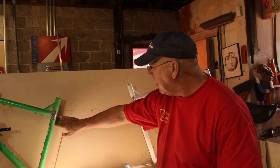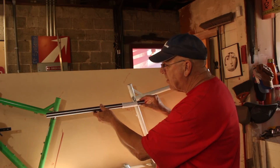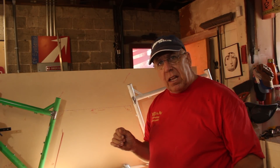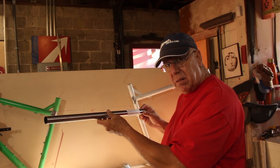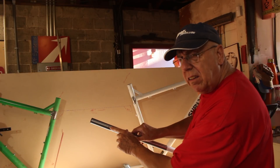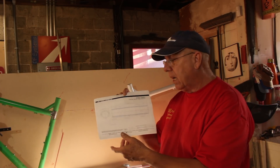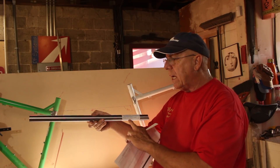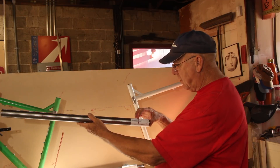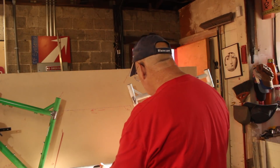Getting over here into the front, I've already done the layout on my backboard with the angles. I need to cut this side first so I know where to place the template on the other side. That could be derived mathematically, but I'm just going to do it old school and fit it together manually. I know I'm within the double-butted area of the tube, and I've marked the other end so I'll be in the double-butted area there too. I know where the double butting is because I have the actual blueprint of each tube — this one has 105 millimeters of double butting on one end and 95 millimeters on the other. The bottom tube has about 60 millimeters on one end and 200 millimeters on the other, and we're going to use almost all of that tube anyway.